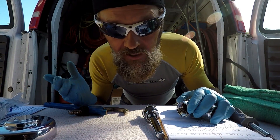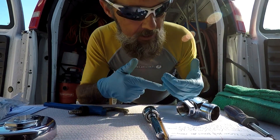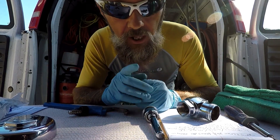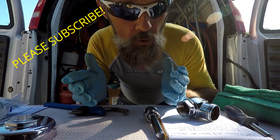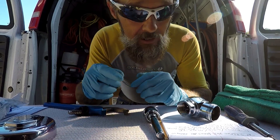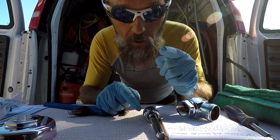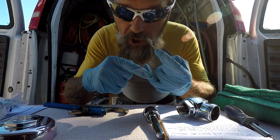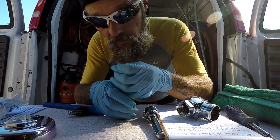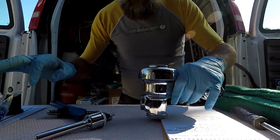It sounds like rocket science but it really isn't — it just works off pressure and timing. Inside anything mechanical, things can fail and wear out, but luckily Sloan made pretty basic universal replacement parts. Remember: if you're working on a urinal, you want urinal parts; if it's a toilet, you want toilet parts. Don't combine these — some can be low flush, some can be high capacity. You don't want to put the wrong part in your valve because you won't get the performance you're looking for.